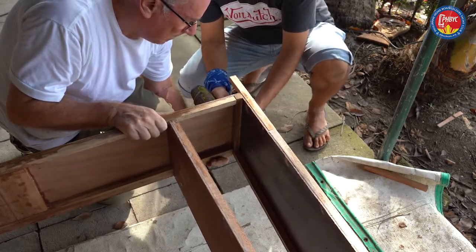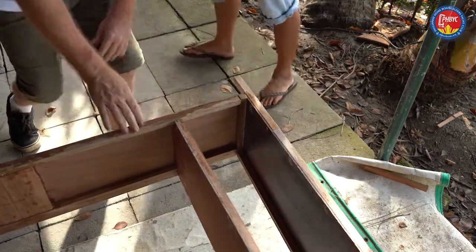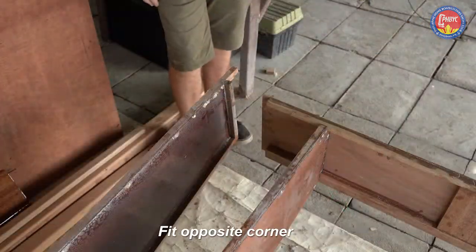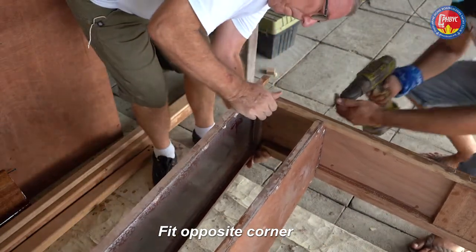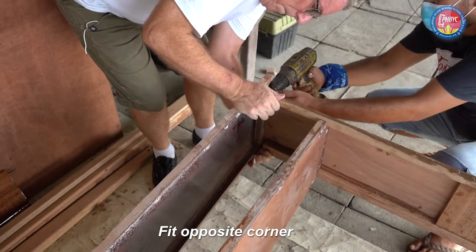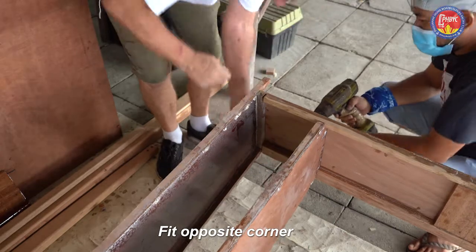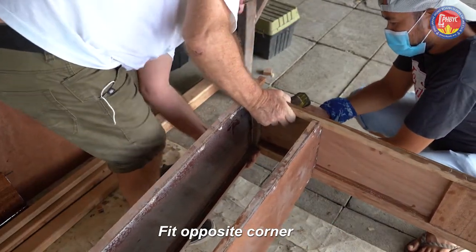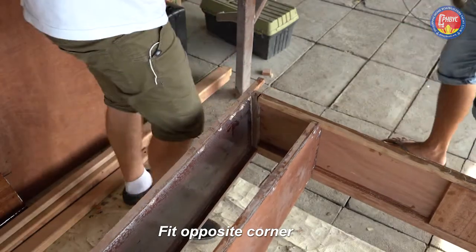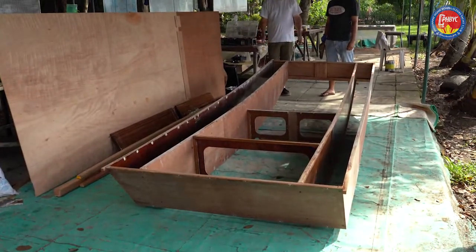Plywood at the top lined up, push the gap closed, make sure the gap's closed at the bottom, and then the screw goes in — just two screws total needed for these edges. The second side has no problems with lumps of epoxy, second screw, that's done. The building of the boat is a bunch of small steps — get each one right and it will be great.